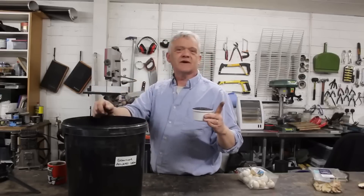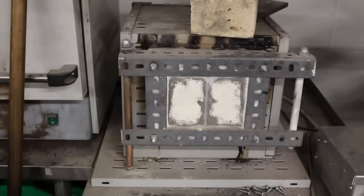Now we need to put it into a kiln. This is the homemade kiln I made about two years ago. Put the mushrooms in there, turn it on to 700 degrees centigrade and just let it ramp itself up. It ramps quite quickly — sort of a degree or two a minute. Get it up to 700 degrees centigrade and then leave it for an hour.